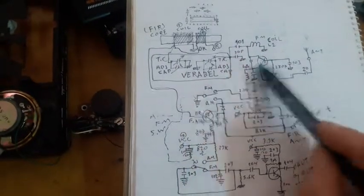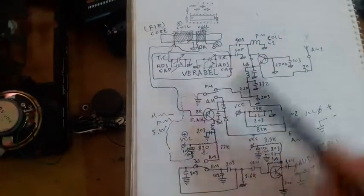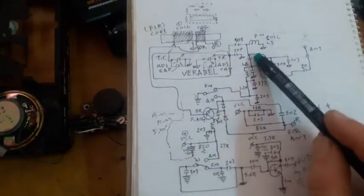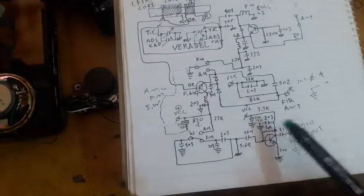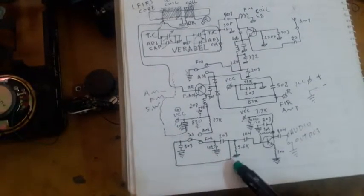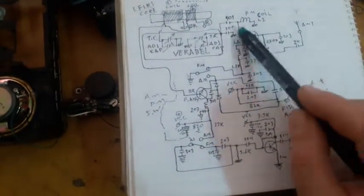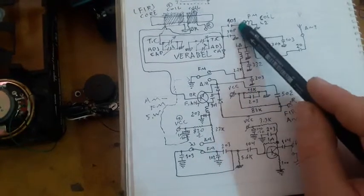The VCC or positive is connected to that special symbol, which acts as a local positive rail in this circuit. The frequency and IF signal are fed through here, giving us an amplification circuit, and the audio line comes out of this trace. Moving to this side of the circuit, this is the audio amplifier transistor, and in the FM position we can see how the amplifier receives the signal through the 5.6K resistor — the antenna signal is amplified and tuned by this capacitor and this coil.